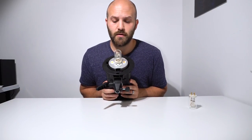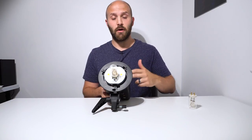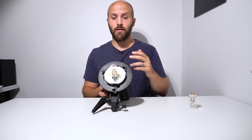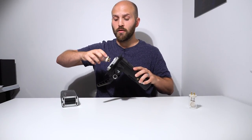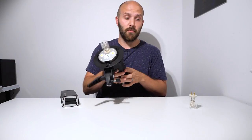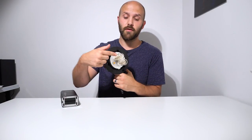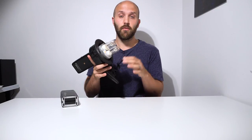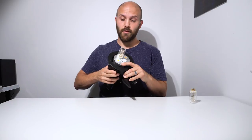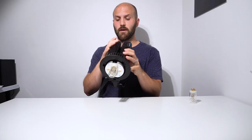Now let's talk about some other questions I've been asked. One power pack will not fire both ports under any circumstance, and it will also not illuminate both LEDs. So putting a single pack on is going to fire the top bulb, but that bottom bulb isn't going to do anything — you're better off putting it in the center. That independent wiring also applies to both LED panels — there is no way to operate both LED panels with a single power pack.